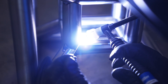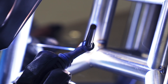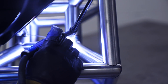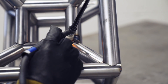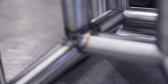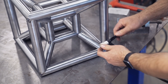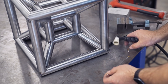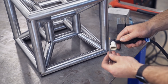Once tacked, it was time to start welding. I'm using my Lincoln 185 air-cooled TIG welder with a Miller torch — that's because Miller owns Weldcraft, so it's actually a Weldcraft torch. I have my Furick Fupa cup on the end so I can run the tungsten out a good amount. I noticed pretty quickly I was going to have to switch to a short back cap to get into these tight areas. You could weld this whole thing with the longer back cap, but you're going to have some less than ideal torch angles.